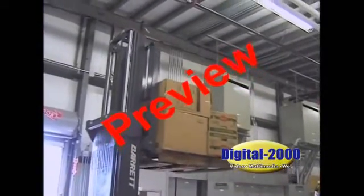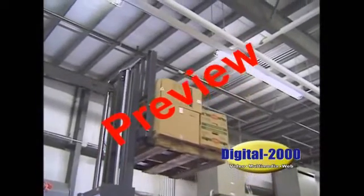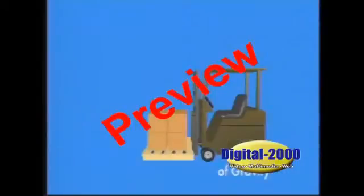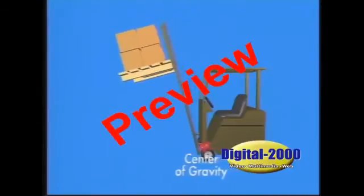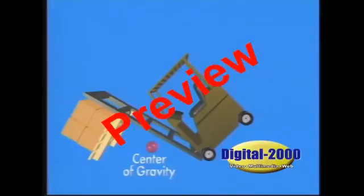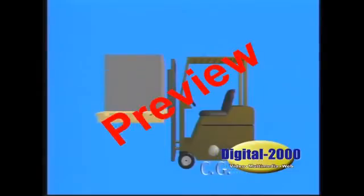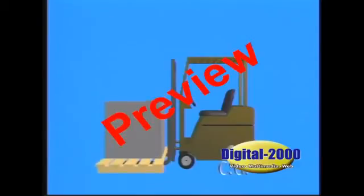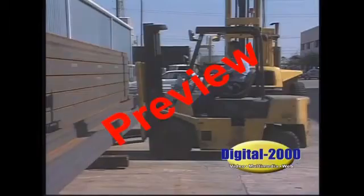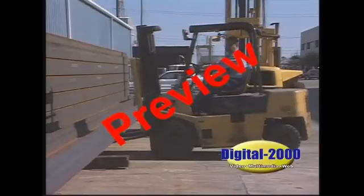Remember, when we stated all these capacities, it included keeping the mast in a vertical position when lifting. If you tilt your load when it's raised, you're changing the load center. If you have a maximum capacity load on your forklift and you tilt the load, the forklift may become overloaded and tip over. There's another engineering principle that's important to keep in mind: your forklift's center of gravity is somewhere towards the rear of the vehicle. This center of gravity shifts towards the forks as the load is raised. Forklift manufacturers take the shifting center of gravity principle into account when they determine the lifting capacity of the vehicle. Operators should also understand this principle, because you may lift over-capacity loads and when you try to raise the load, the shifting center of gravity may cause the forklift to overturn.